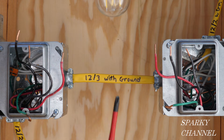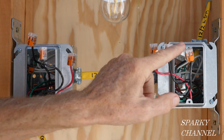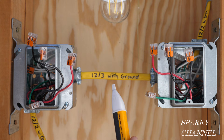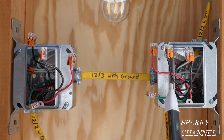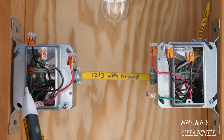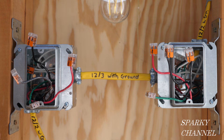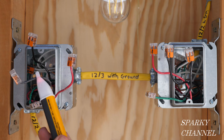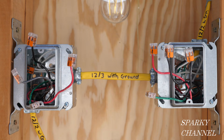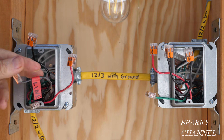I've put wire connectors on all of the wires for safety, then turned on the circuit breaker. I'll take my Fluke voltage detector, which we've already tested, and I'm looking for a live wire. There's only one wire that's going to be live — and here it is right here. We call that the line wire. I'm going to take a piece of red tape and mark it 'line' right here.